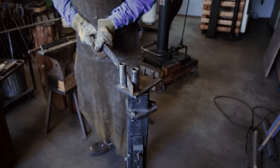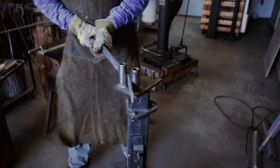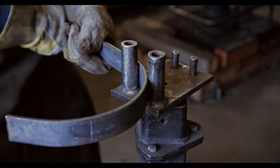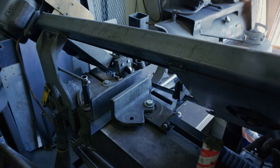The flat bar will hang over the jaws of a leg vise and needs some curvature to stay in place. Since the flat bar is thin, bending it cold is easily possible. Since I mentioned the need for pressure from three points, I will be making three separate pieces that can be positioned on the vise as needed.